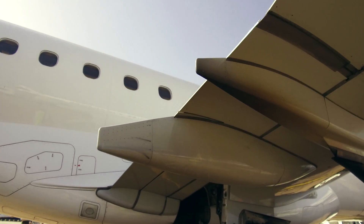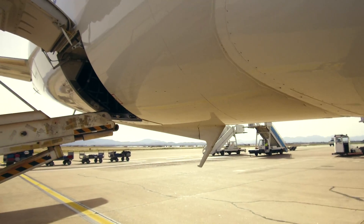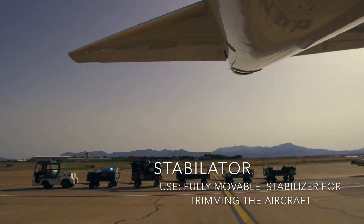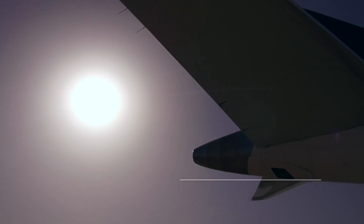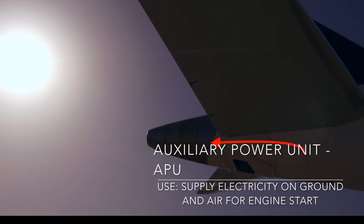While walking back, take care that the flight control surfaces and the flaps have no damage. Finally, you should have a look at the condition of the stabilizer of the aircraft and once again that the static discharge wicks are in position. Moreover, the control surfaces and the exhaust gas outlet of the auxiliary power unit have to be checked.